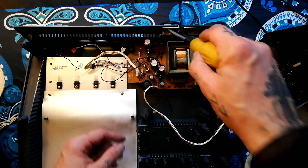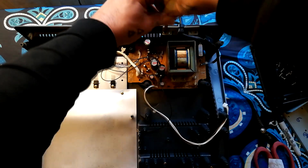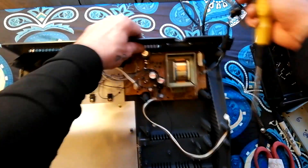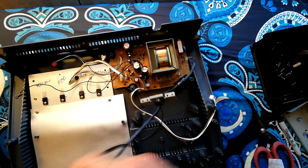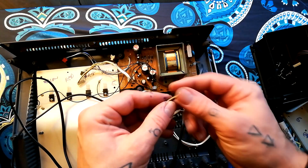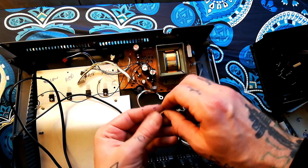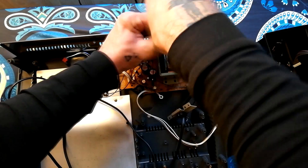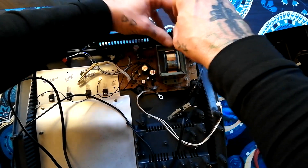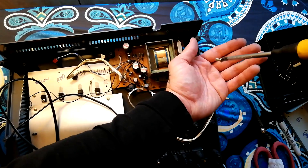There's also one screw attaching this plate. It sits on a black plastic pin on the other side, and that's where the mains wire comes into the unit. Taking out these four screws — see how these are very long, quite thick ones with a very thin ferrule going into the metal plate underneath. It's also useful to have a magnetized screwdriver. That all comes away as one unit.